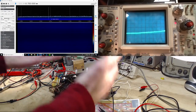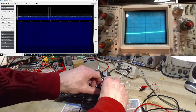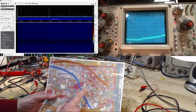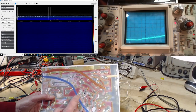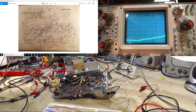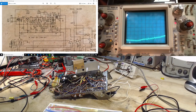Okay. Kind of gone through where I've gotten previously, so I'm at the point now where I have to make a decision about changing this transistor because I don't know what else to do, or really focusing on this anomaly. The anomaly is the emitter voltage is supposed to be 2.2 here, and I measure 0. Let's verify that. So on the emitter that's here, 2.4 volts should appear. I get a 0 here.